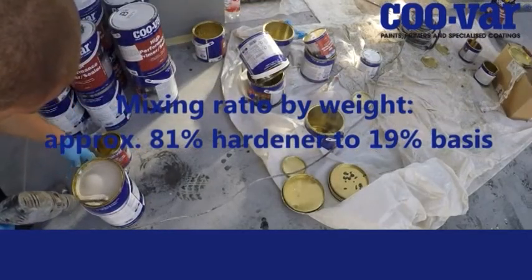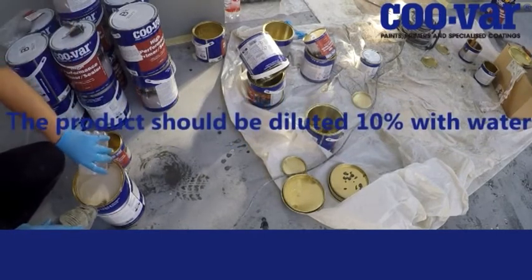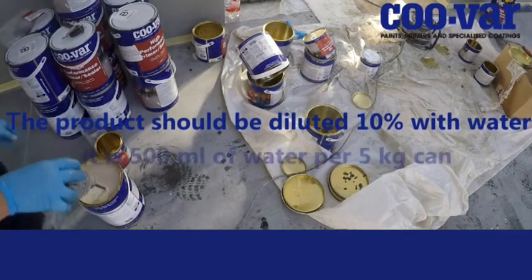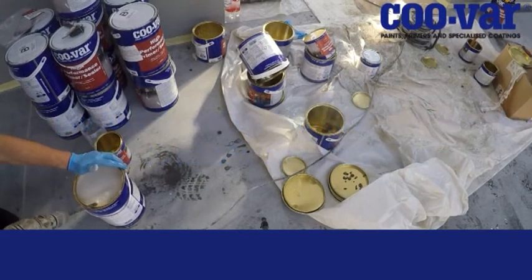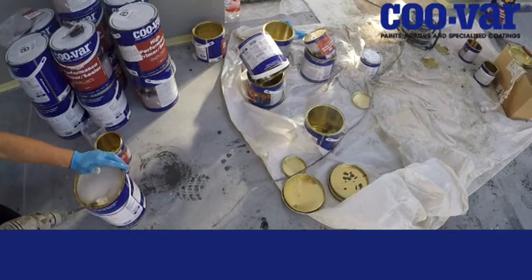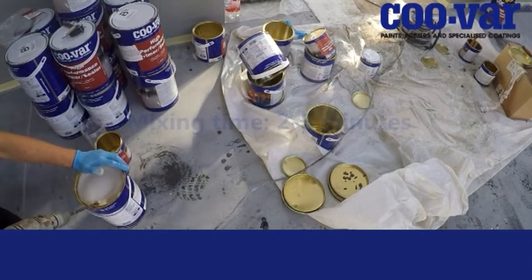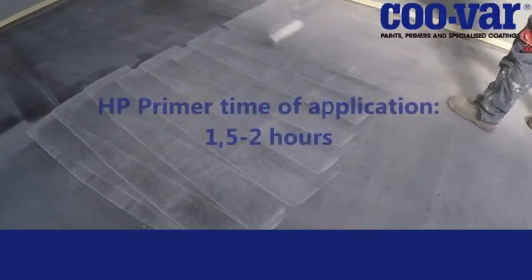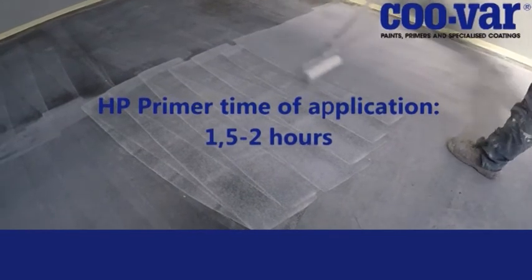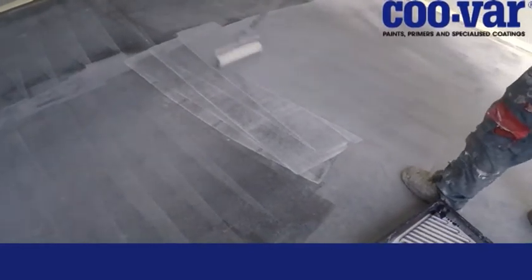The process of mixing is to stir the contents of the large can to mix the colour, then slowly add the hardener from the small can. Ensure all the contents are added. Stir for 3–5 minutes with a slow paddle on an electric drill to avoid aeration if possible. At this point 500ml of water should be added and stirred for a further 3 minutes. Once mixed it will have changed from a honey colour to a milky colour — this is a good indication that it is properly mixed. At application it will be a milky colour but once cured it will become a translucent honey colour. This is normal.